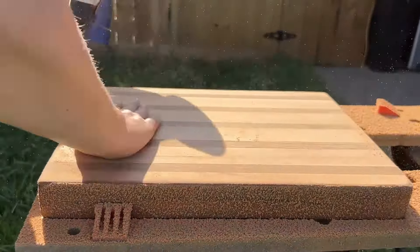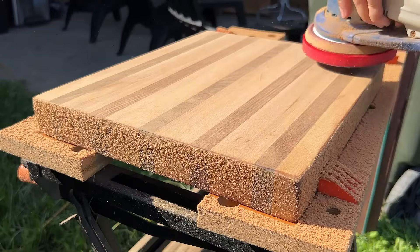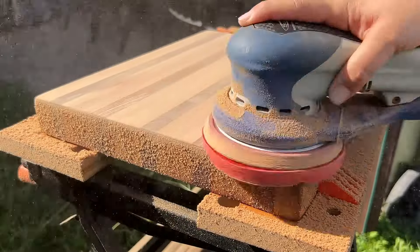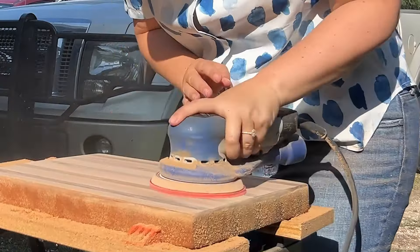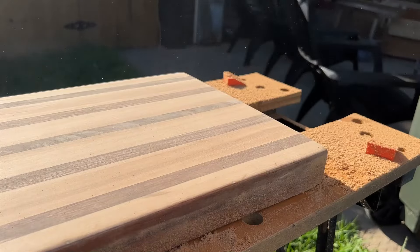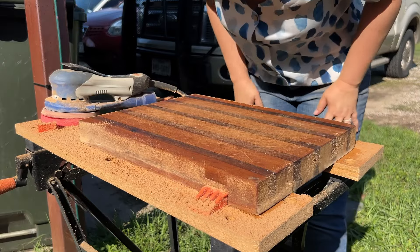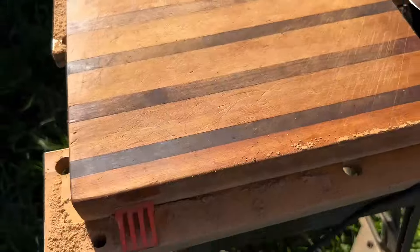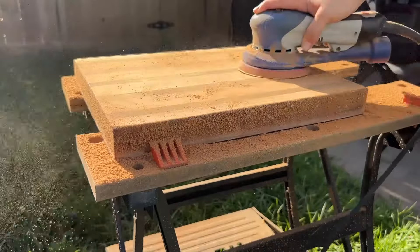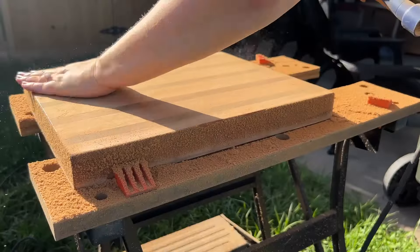Can you already see the difference? I am getting so excited. You can tell the cutting marks are already disappearing, so we're going to switch to the medium grit. This is close to a 120 grit with Surf Prep sandpaper — they call it fine and super fine — and they have these sanding pads that really protect the wood, and I absolutely love that. I think the other side is even worse than the first side, so back to the low grit. This is an 80 grit sandpaper and we are using this to get rid of all of those cut marks.